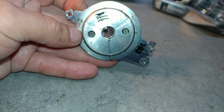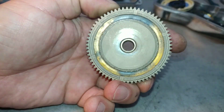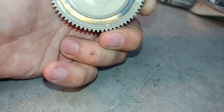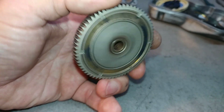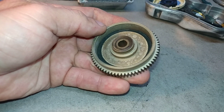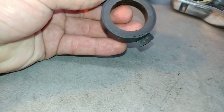When I open it up, the return spring looks alright. But then we go to the main gear — as you can see, the main gear has these black spots over here. That's not nice. This is like the first sign of overheating, so you don't really want to see this. If you flip it to the other side, you can see lots of black stuff — this is dust, rust, and heat — all of that. So that's not great.